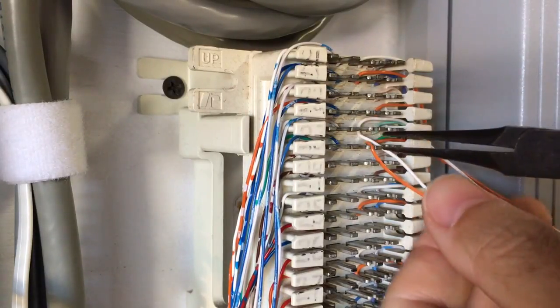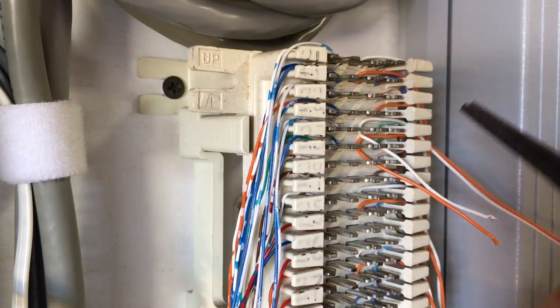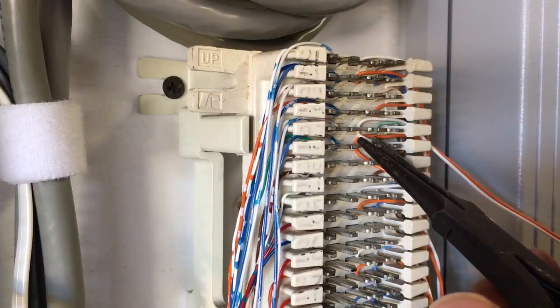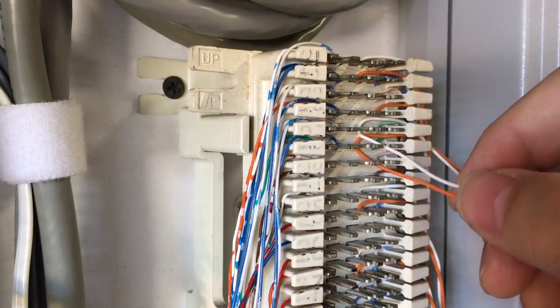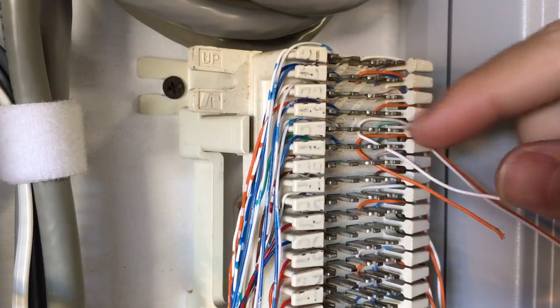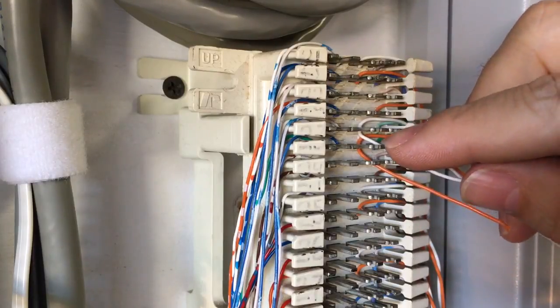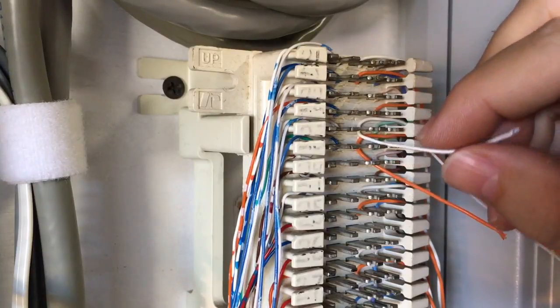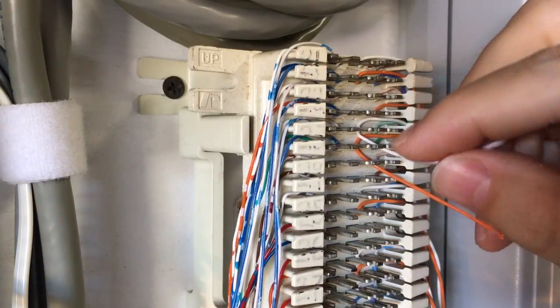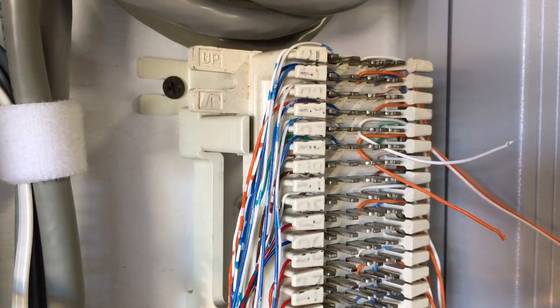I'm going to do it one more time for the other wire — pushing it all the way back to the bottom and then giving it a little tweak to tighten it up. Now we've got this slack. You may be tempted to say, 'I'll just use some scissors and cut off that slack,' but that's not a good idea. You're not going to be able to get close enough with scissors to trim it without leaving a dangling tail, and you don't want a piece of dangling copper that could contact the pins below and short out your circuit.